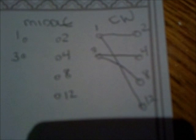And of course in the middle, everything's disconnected, and clockwise, which is the lower, or whatever you want to call it, turns to the right. It still puts the hots 1 to 2 and the neutrals 3 to 4, but it is swapping the 8 to 12. So now 1 goes to 12. So I know 8 and 12 wires are going to my starter, because that's what you do, you reverse the starter wires, the positive and the negative, to go different directions.